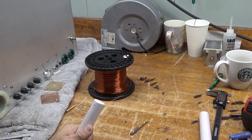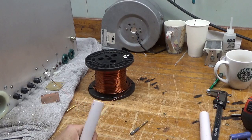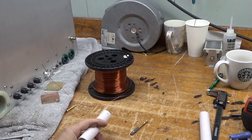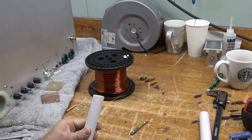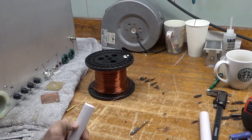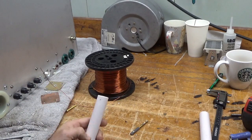This morning we're going to make the plate choke, and I'm also going to install the plate choke and the caps below the plate choke. I constructed it just like Henry Radio did in their RF generators and their ham amps and other manufacturers — it's good design. The specs for this frequency for this particular choke are coming from my friend in Canada. I already knew the gauge wire to use.